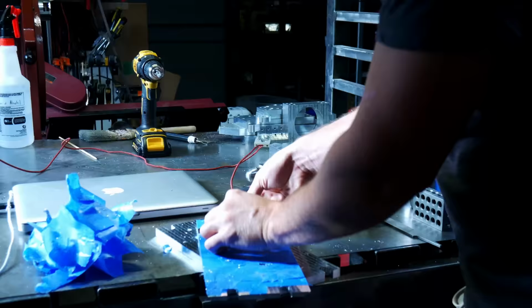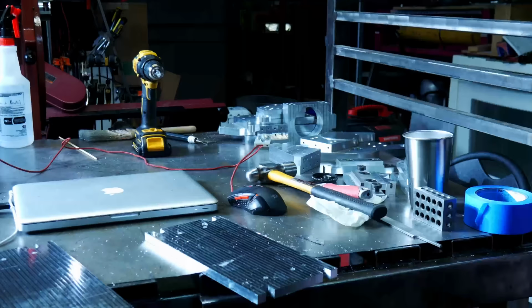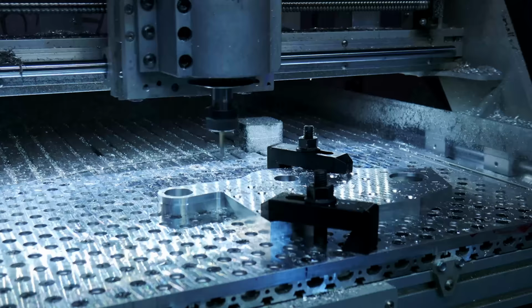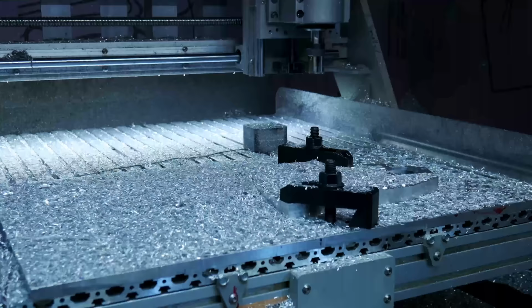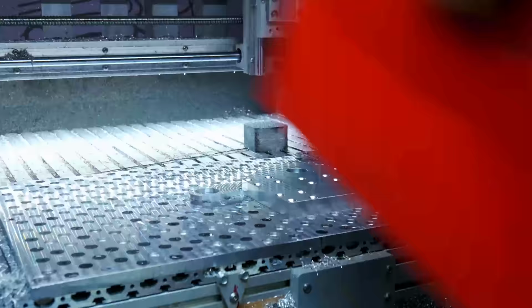When you use a flat end mill, it doesn't give a great surface finish. But I need a flat end mill to get all the way to the bottom. And surface finish isn't as important as precision, really. And then some of these parts needed machining on the back sides after they were cut free, so that's what you're seeing here. The little cutout is for an end stop.